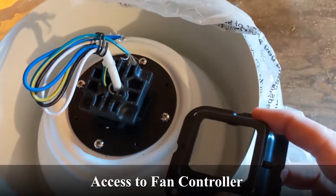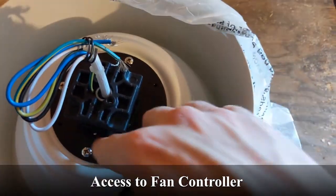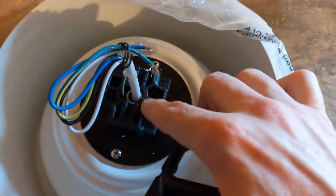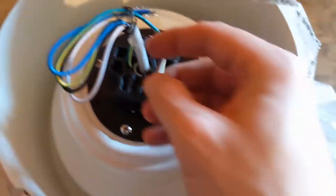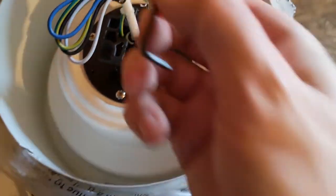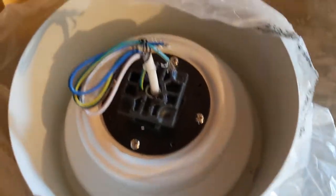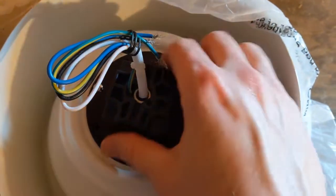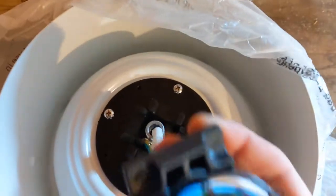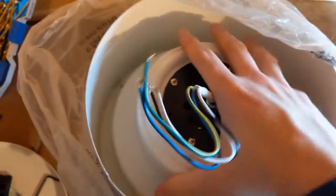I'm going to take it off. So pulling off the top on this right here, you have four screws that go into this metal piece right here - these are the ones to remove. There's a fifth screw right here with a wider flange around it, you pull it off. Then you have this metal retaining piece that keeps it in place. What I did is I took an Allen wrench and tapped it with a rubber mallet until it came out the side through here - it popped out here. And I'm ready to pull this thing off.